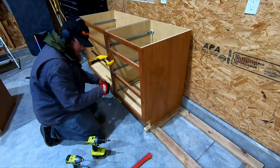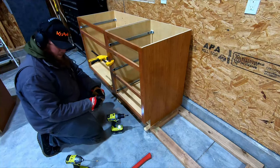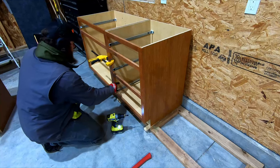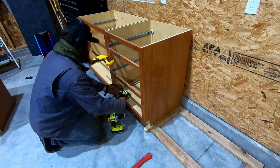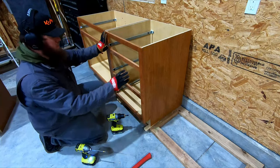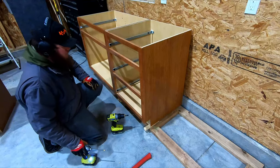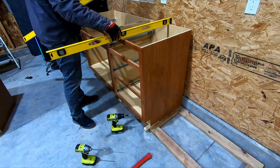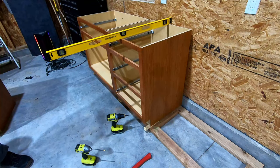There's the first one — bottom is still flush. I found if you don't eject the sawdust on this type of bit, it seems to smoke badly. I'm not sure why that is — if you guys know, drop a comment. That's all flush now. Level is nice and horizontal, and vertically also level. I'm going to put the 2x4 scrap shims back there and then screw this into the wall.